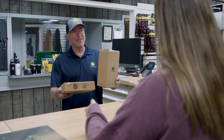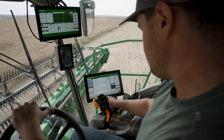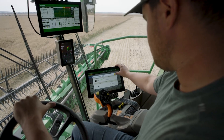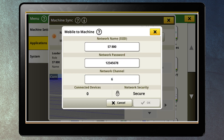Additional antenna kits for the tractors can be ordered through the parts department of your local John Deere dealership. Once installed and activated, turn Machine Sync on for each machine in the work group. Machine Sync can be accessed from the shortcut bar on the display. Ensure that all machines share the same network details by adding all combines and grain carts to the same in-field data sharing work group, with the same display software across Gen 4 or G5 displays.